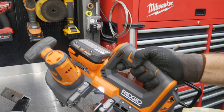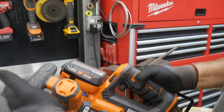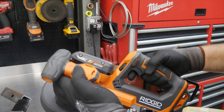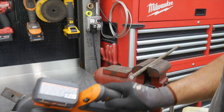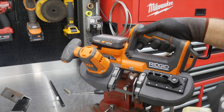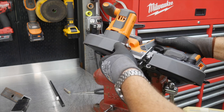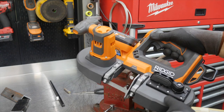I like it — I like the size of it. Let's put it on the scale and see what it weighs. It's a very handy tool, I can one-hand it if I need to, use two hands for a 45 or when I need to be on my mark. I'm using a two amp-hour battery, made a few cuts, still at three bars — I don't think this is a tool where you're going to wear a battery out. Even as a brushed tool it works quite fine and doesn't really need to be brushless. I like the multiple bearing design providing that track for the blade to stay in.